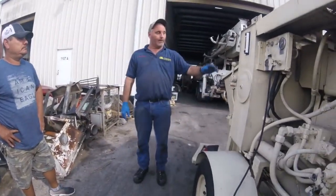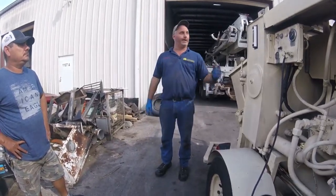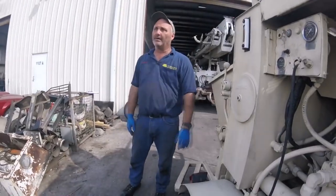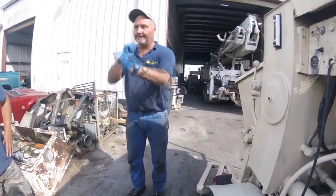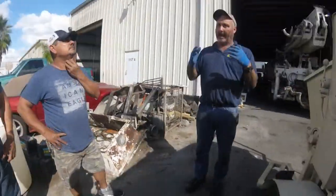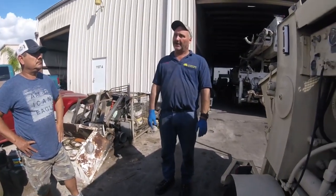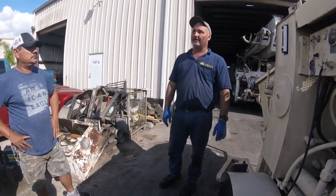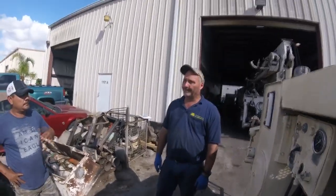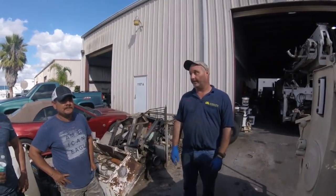Now, once a year, you're gonna clean this out, whether it be a filter cart or just putting new oil in. But you filter it going out, filter it coming back in. There's one inspection port. You take it off. What I do is brake clean and vacuum it, put it back on once a year. AW46 is anywhere 4,000 hours. You'll get your 4,000 hours if you clean it. If you don't, it'll turn black and that's it, it's done. There's $400 worth of oil in there. So to get your longevity out of your oil, you can replace it every year if you want to.